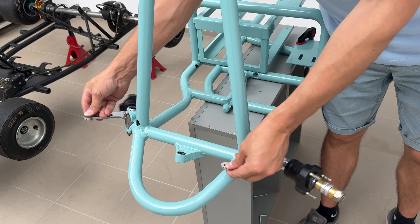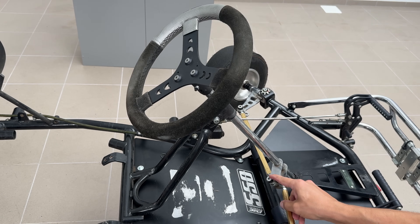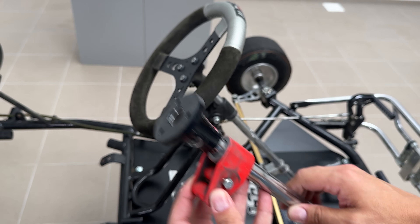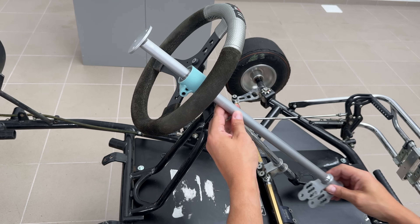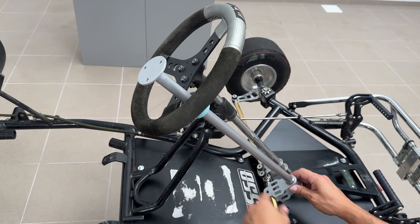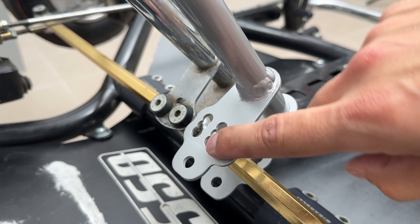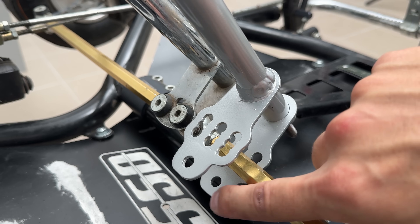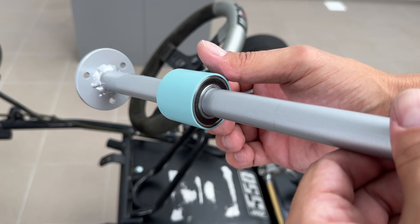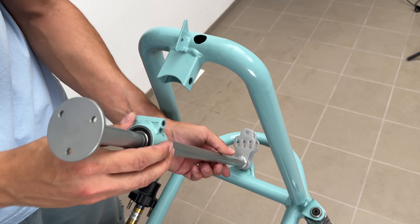Three places weren't suited to my build needs, so modifications were necessary. The plastic holder of the column shaft was worn out and had a lot of play. I cut out the bottom part and welded in a new pipe with a few additional modifications. First, I made a small extension with a single hole to connect the steering rod ends, which improved the wheel turn angle — also known as lock in the drifting world. Second, the worn out plastic column holder was replaced with a pair of bearings and a DIY holder made from a piece of pipe.